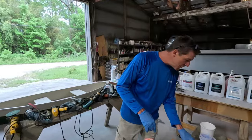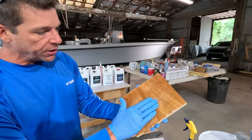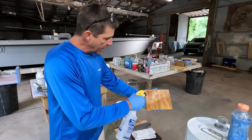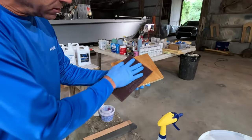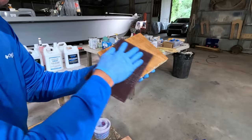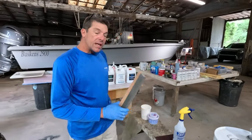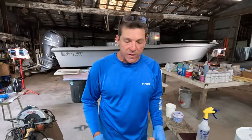Going back — we've got a sample piece of epoxy where we've just clear-coated some marine plywood with epoxy. It will produce an amine blush, and if you're going to be fiberglassing over that, the way to remove the amine blush would be with some water and a Scotch-Brite pad to scuff it up. Then rinse it off and you can even dry it with a heat gun. That sounds crazy — putting water on it — but that is the recommended way to remove amine blush.